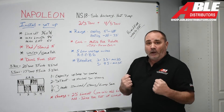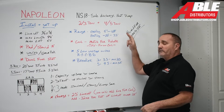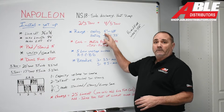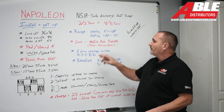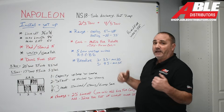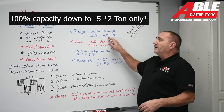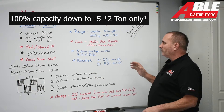The operating range for cooling is 5°F to 129°F. This is important — you're not going to use this in a server room where you may need to cool below 5 degrees. For heating, the range is minus 22°F to 75°F, so if you need heat above 75 degrees, you have to go a different way. It's 100% capacity down to minus 5°F — truly amazing.